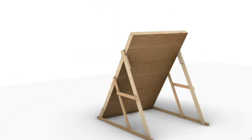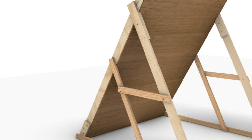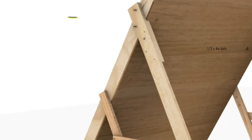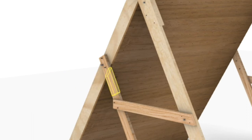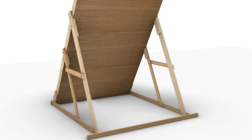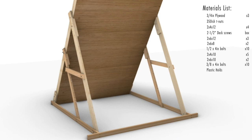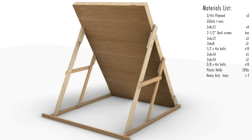The last step was adding the final screws and bolts tying the whole thing together. We added a half-inch bolt connecting the 2x6 to the wall, and a 3/8ths bolt on the smaller member. There's also another 3/8ths bolt connecting the base of the wall to the feet. For extra support, we added two smaller shelves out of scrap 2x4 on the smaller diagonal members, with the same bolts and screws mirrored on the other side. That final 2x4x10 was screwed into the front to keep the supports from moving.